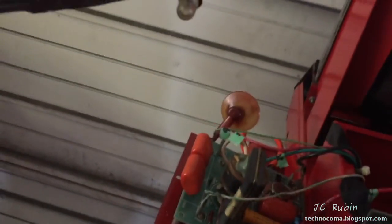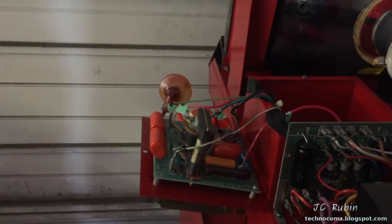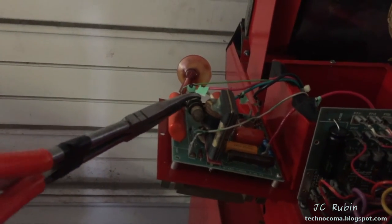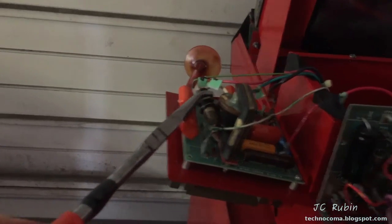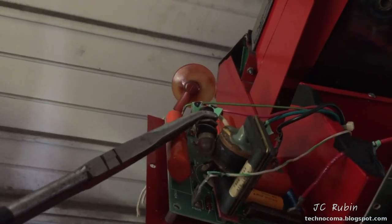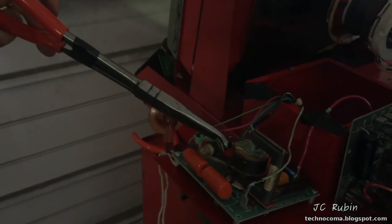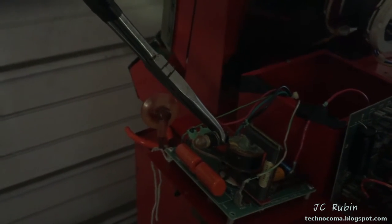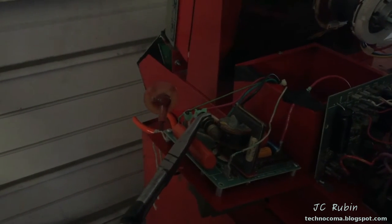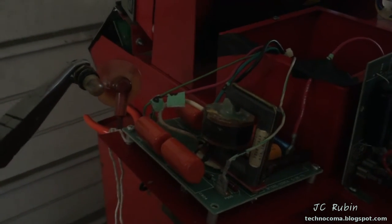Let's get started — fire it up, fire in the hole. We're hot. We'll let the fan come up because it pulls excessive current when turning on. Now we're going to hook the bulb back up again. I see a little bit — do you? I don't see anything. It's the orange from the polypropylene capacitor. So I'm going to come right off the connector again and see if we see anything. Nothing. Absolutely nothing. So hooking up that doubler/tripler is killing this entire circuit. This flyback transformer does not function at all anymore when this doubler/tripler is hooked up to the circuit. We're going to stop it right there.